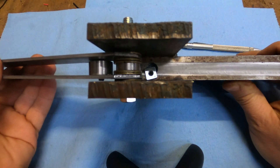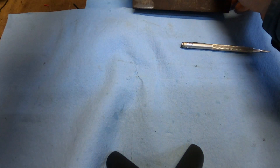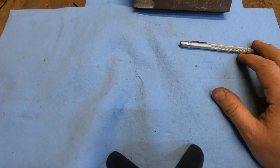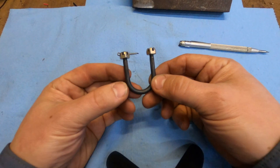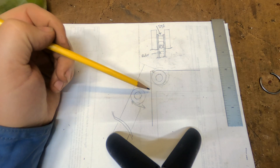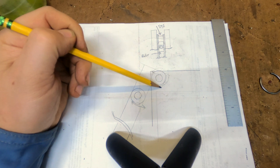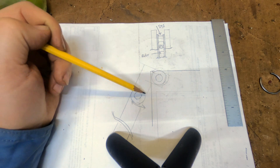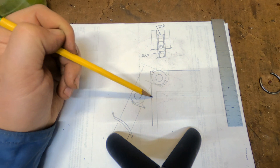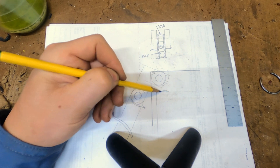The very last thing was just running a drill bit through the holes by hand to clean things up, and then annealing the part so it doesn't have any stress in it for their application. So the geometry of the jig, looking like this from the side, is where the handle — the square profile here — protrudes out somewhat from some relief that allows this roller to get all the way up against this side of the inner portion of the fixture.